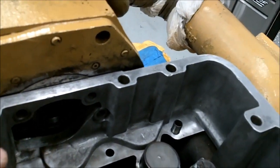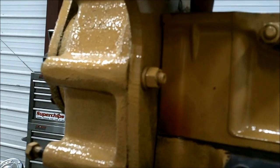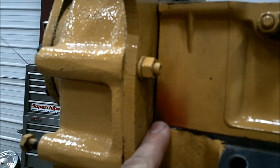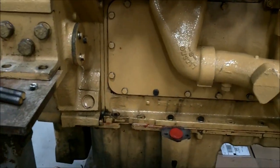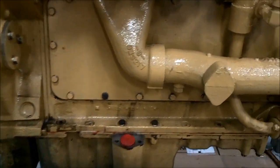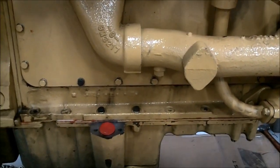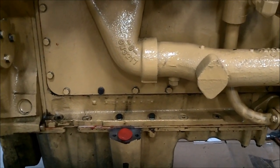Most D343s are a stinking oily mess because right back in here they won't get this gasket sealed up good — you've got to really put some silicone in there. They'll also leak on the pan. We silicone both the plate and the pan before we put it on. You torque it down just lightly until the silicone comes out, and then you want to let it sit for a while before you put the final torque on it.